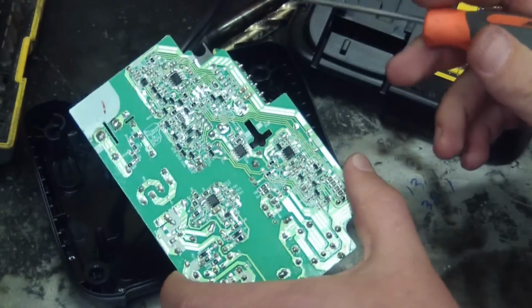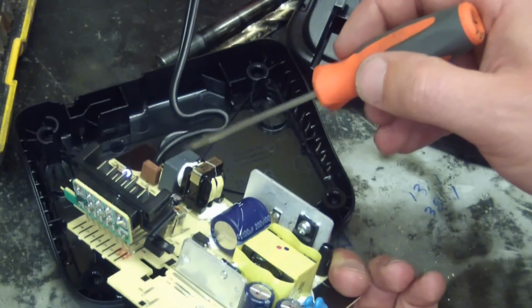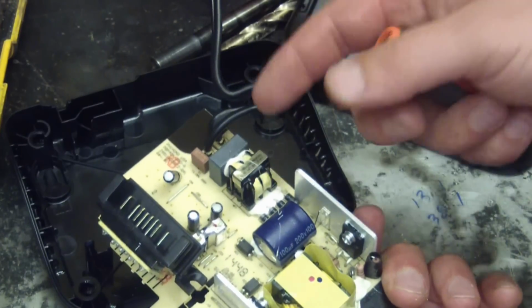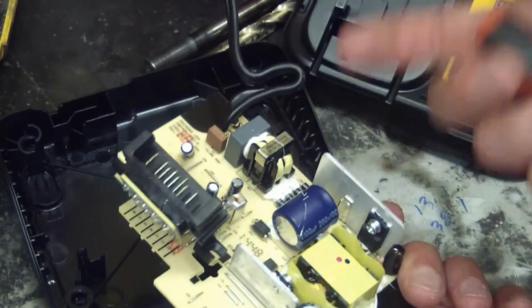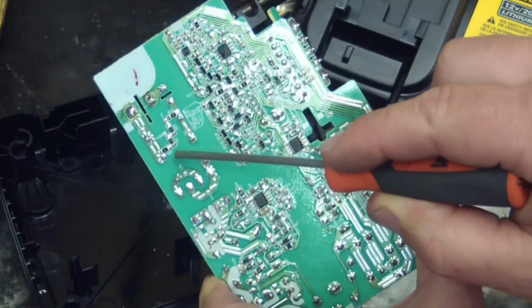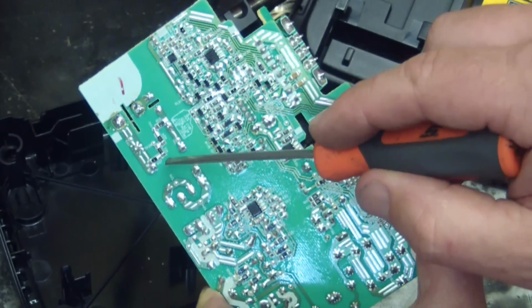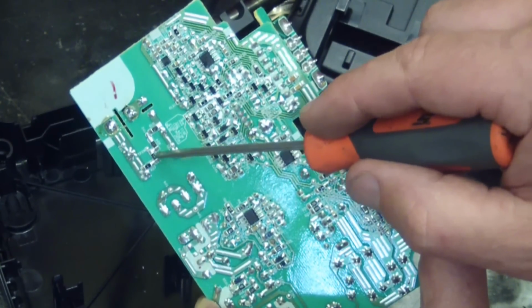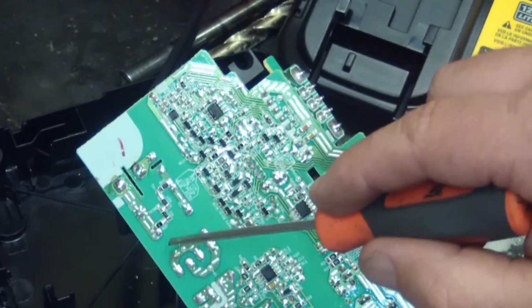interesting thing, cute little detail here. So this is a big capacitor. If you just plug this into the wall and take it out, it'll be powered up. You know that old joke you used to play in high school? You'd stick it in the socket and then toss it at your buddy and he'd catch it and get a shock. Well, you'd get a shock if they didn't have these bleed down resistors. Normally you would just have one through hole bleed down resistor, but this is, I checked it, 3 megaohms, and I guess they couldn't get surface mount stuff to be 3 megaohms, so they got a little ladder here.